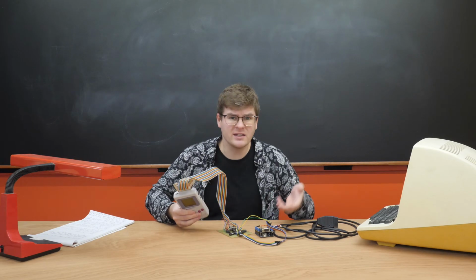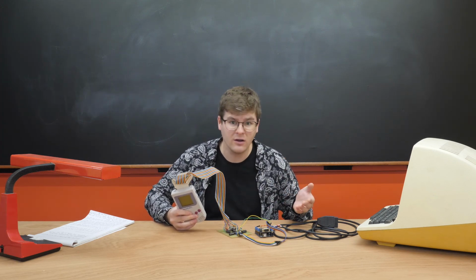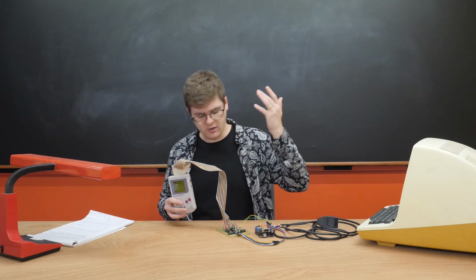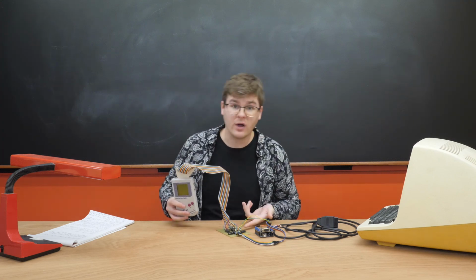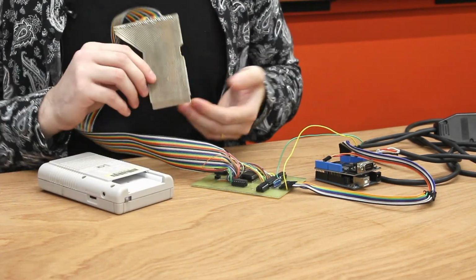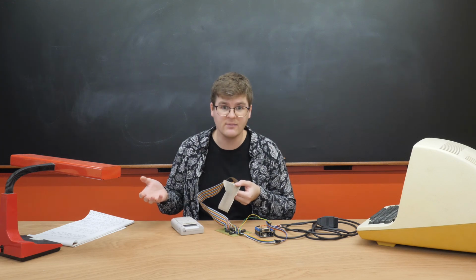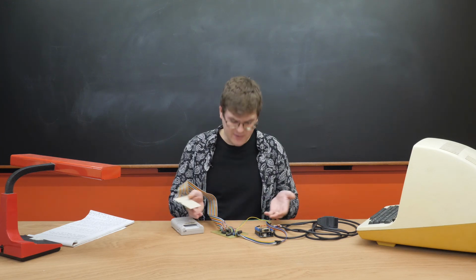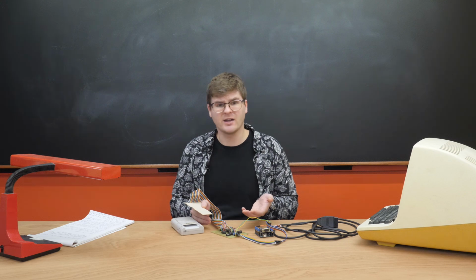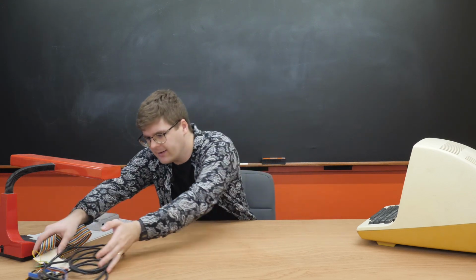What, do you think this was the end of the video? Do you think I'm really happy with this clutched together mess sitting in my car? I mean, we got wires popping out all the time, the socket for the ROM chip's flaky, and just take a look at the edge connector here. It's completely tarnished and makes terrible contact with the pins inside the Game Boy. I mean, it's pretty okay for a prototype, but it's not something I'd want to end the video on. Let's just move this out of the way.